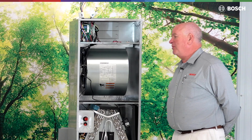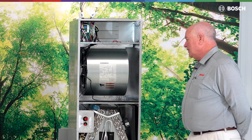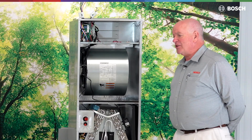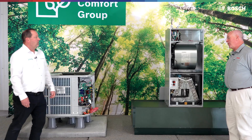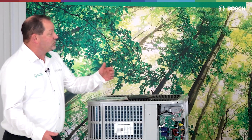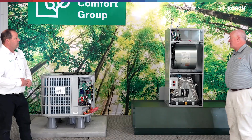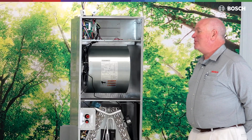So we have a P and Q terminal for communication. The P and Q is going to communicate to the outdoor unit and tell it what it's doing for the dehumidification process, for setting the cool temperatures, for choosing fan speed — all that comes through with the communication. But we don't have to communicate if we don't want to. What that's going to do is enhance dehumidification mode, enhance that process, give us better comfort, better cooling — perhaps running dehumidification beyond the set point.